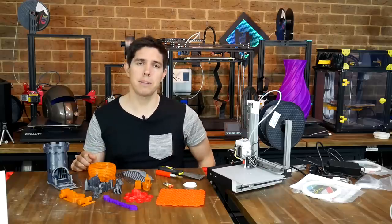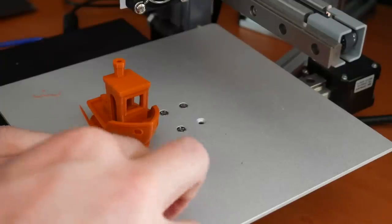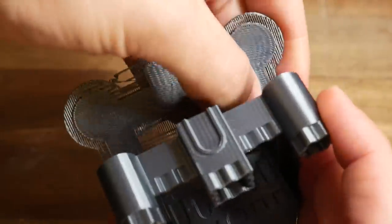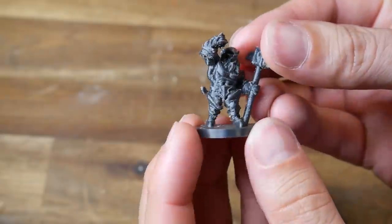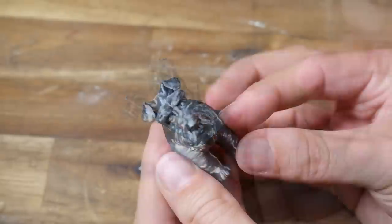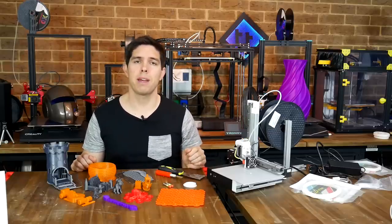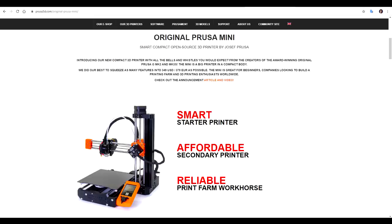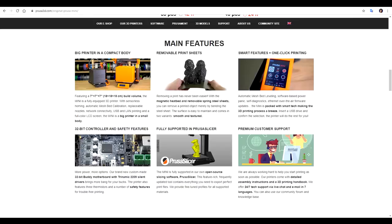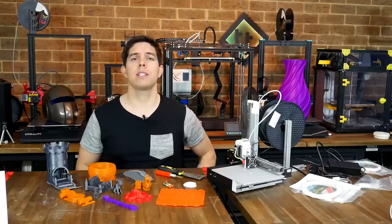This thing is so close to being an excellent beginner-friendly 3D printer, but these few compromises muddy the waters a little bit. After you work out how to separate prints from the bed and how to get the rafts to easy peel, it's probably still pretty close to beginner friendly. The main strength of this printer versus others I've reviewed is probably with the fine nozzle printing miniatures — the quality of those prints is simply amazing, especially considering I've done no slicer tweaking and everything is pre-configured. At this price the printer is not exactly cheap, and that raises the point of competitors. During my review period, Prusa announced the Prusa Mini — very similar in construction with a moving bed on the Y axis, a cantilevered X axis, and a similar build volume — and it comes with an LCD and auto bed levelling from standard, at a lower price. I ordered mine fairly quickly and it will be interesting to see how these two printers compare.